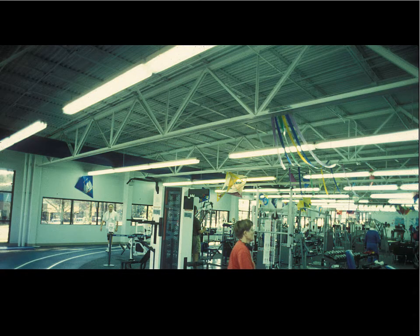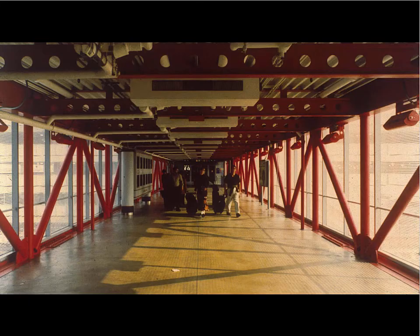Now the material has gotten much more expansive. We have an entire roof diaphragm that represents one sheet of material and a planar truss in the vertical plane that represents another. We can scale that up even larger, and in this case we have trusses that are so deep we've formed a bridge. So on the top here we have a horizontal sheet of material that represents the roof diaphragm, which is very strong relative to horizontal forces.